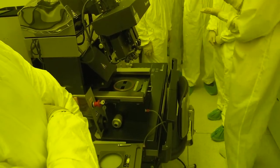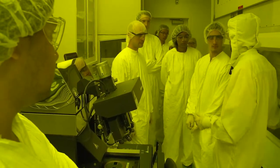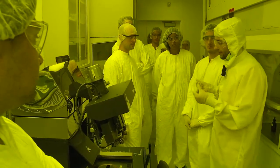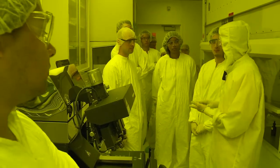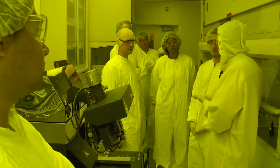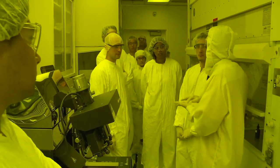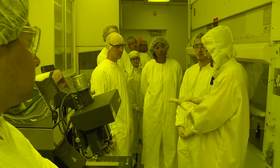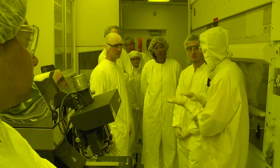You will notice that it depends on the kind of material that you use, but that one is a positive photoresist. So the parts that have been hit by the UV light are degraded. If you develop, they get washed away. They are dissolved in the development, kind of like developing black and white pictures. The parts where you hit the light are removed, and you're going to have naked silicon. On the parts that haven't been affected by the light, the resist, because it's kind of a rubber, is going to stay on top of the silicon, protecting it.